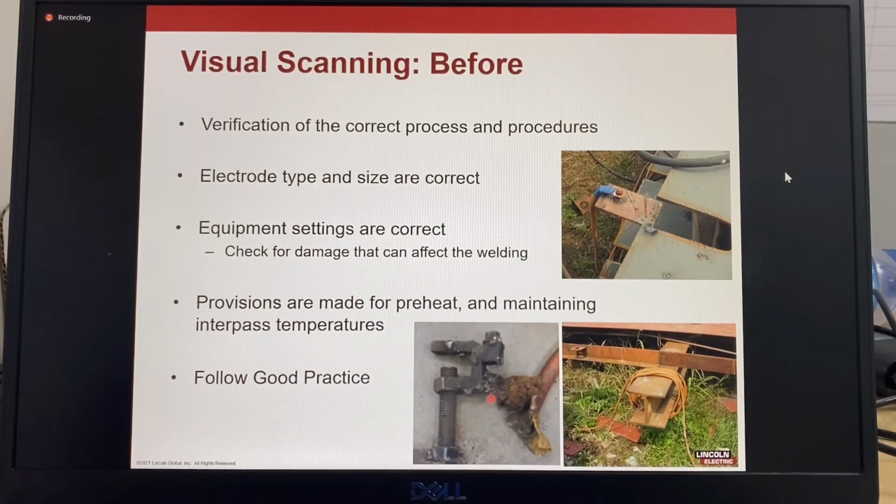Anytime a welding circuit has hot welding cables or hot connections, this indicates resistance in the welding circuit, which will affect the welding voltage. This can cause stick electrodes to be hard to strike, or in MIG welding, if there is a loss of voltage, this could cause excessive spatter or possibly the wrong transfer mode.